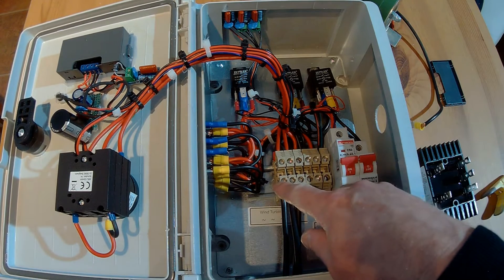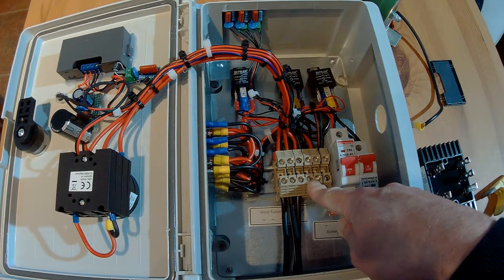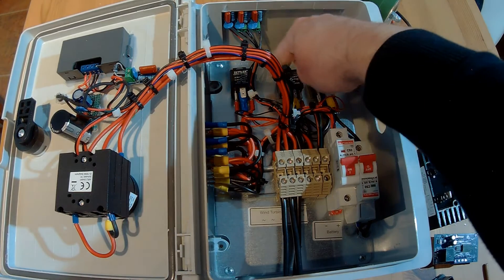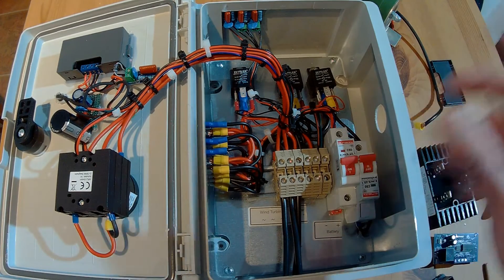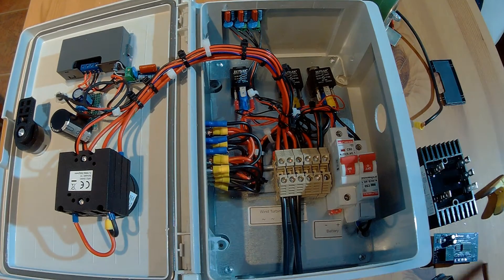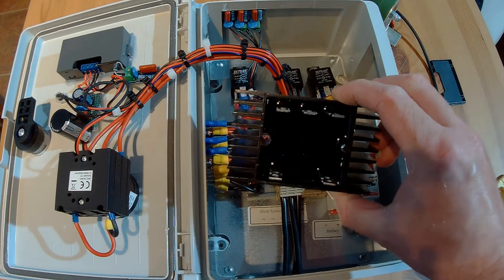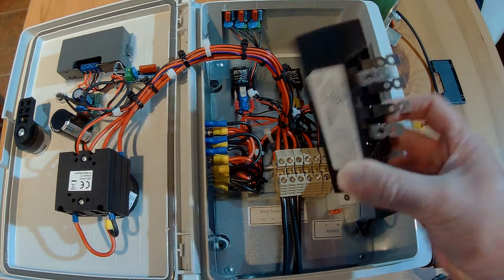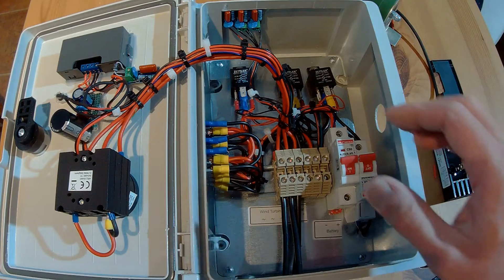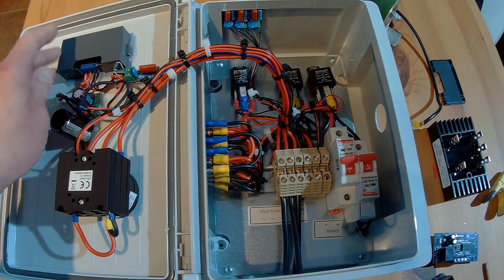Taking a quick look inside, you can see the connectors for all three cables for the wind turbine. This is for the solar panels if you have one, though I would prefer a different charge controller for that. This is for the battery negative, this is for the battery positive, and there's also a circuit breaker inside. The three relays are switching the brake or disconnecting the battery if the voltage is too high. And this is the rectifier — some people use only this rectifier as a complete unit to charge batteries, but that's not the best way to use the wind turbine's power.